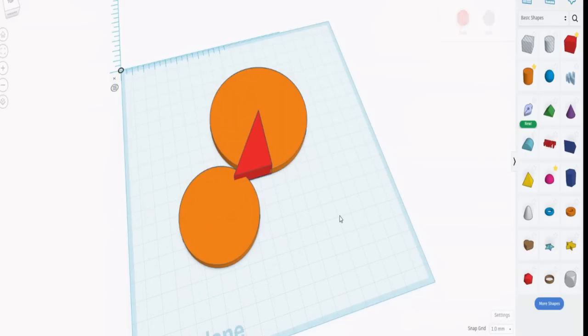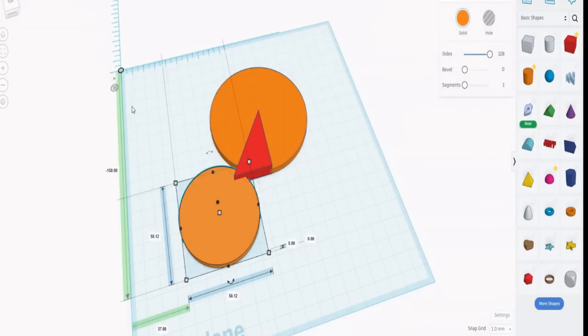So if we set that circle here, go back and now use midpoint. If we set the midpoint to the previous coordinates that we just read, we'll get that circle centered on that point there. So this one, we change to minus 112, and this one we change to 80.94.